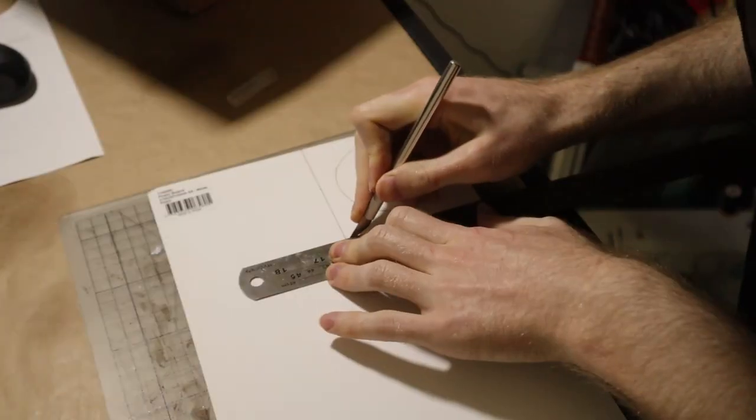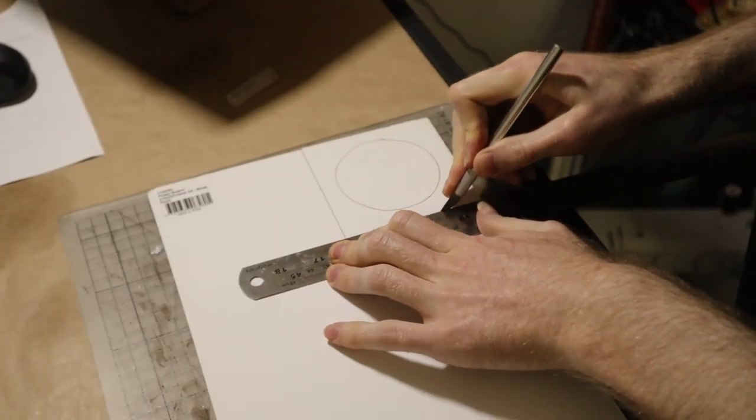That one's on me. The plan was to start by molding the head of the manticore out of some clay, then pouring silicone into that, using that silicone mold to cast a few pieces out of resin, which would then be identical. The plan, such as it was, was to sculpt the clay directly on top of a layer of foam core so that we could later construct a box around it. And so we began by drawing our shapes and outlines directly onto that foam core.